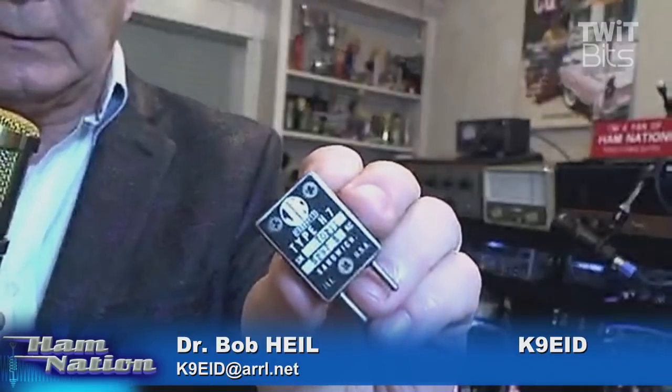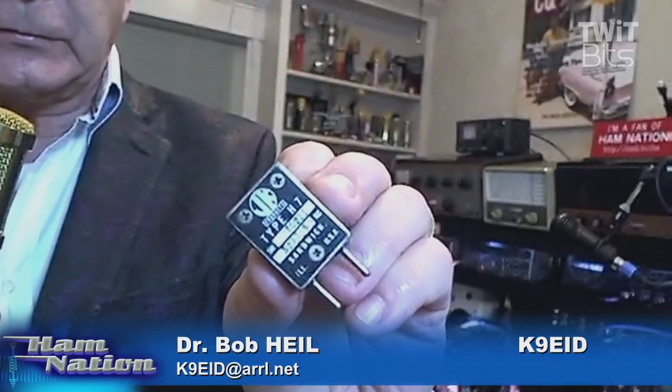I think I showed this one time on the show. There are three little screws in there. You take those screws, the plate comes off, and there'll be this little sliver of crystal. If you want to raise the frequency, you get out toothpaste and a toothbrush and just move the toothbrush up and down on the crystal sliver. If you want to lower it, you take a lead pencil and put some lead on it. You can't change them very much, but that's how we moved around.